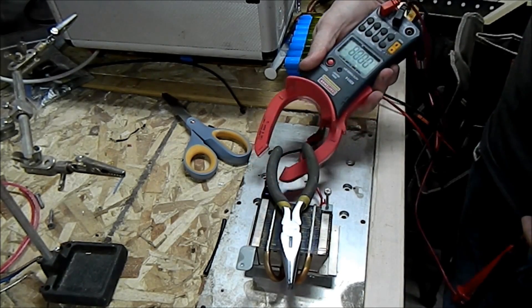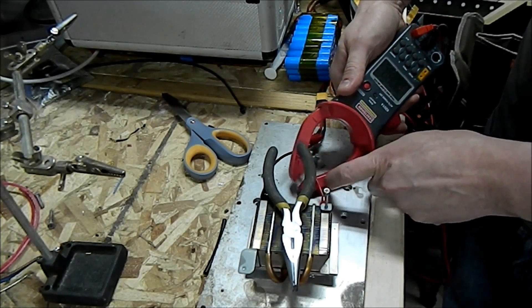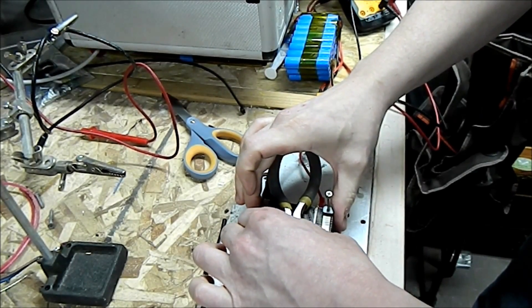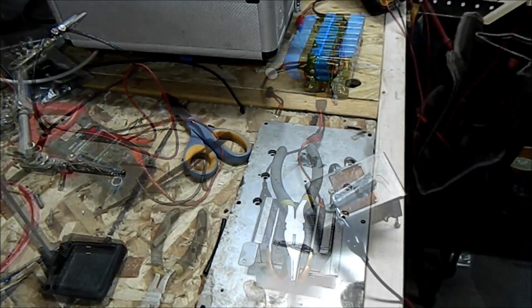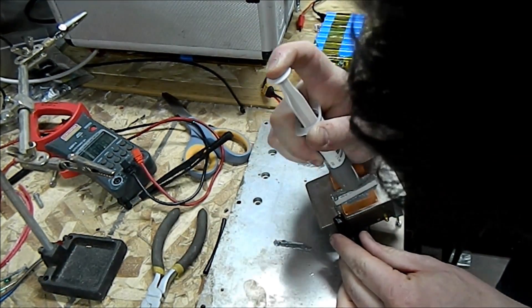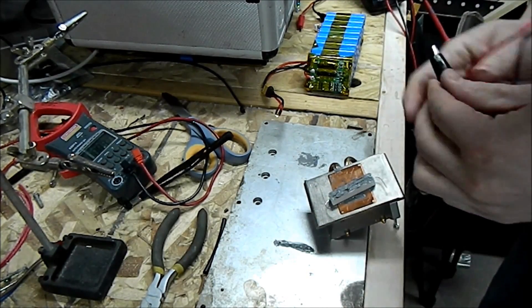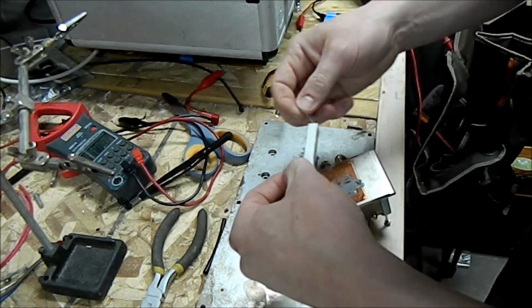7.3 — not as high as I thought. Let's try the other one. We got eight — right between seven and eight is what I would probably say. It's getting hot though, you can hear it. For the record, these are brand new cells — these are not recovered laptop battery cells, these are brand new LGs, so they can handle this no problem.